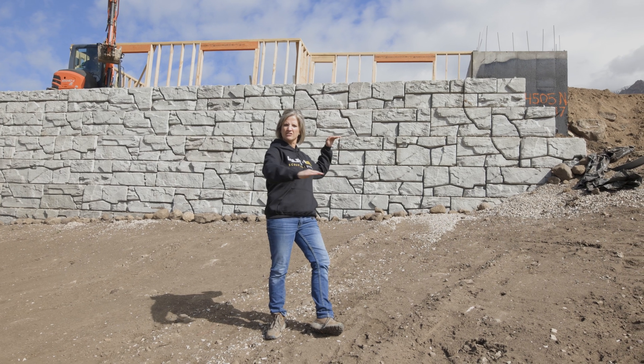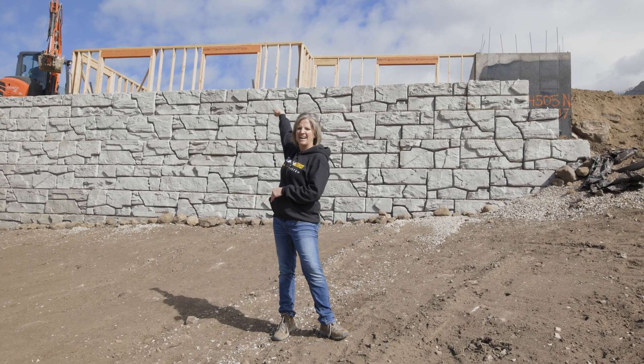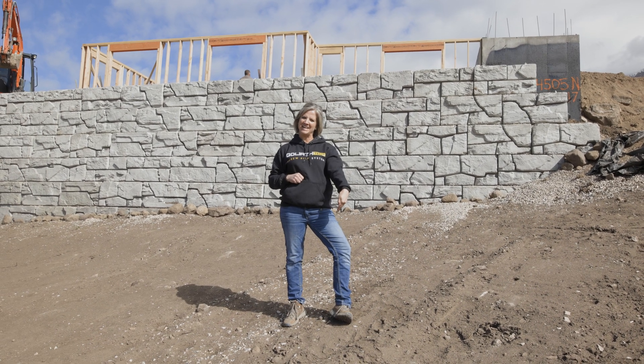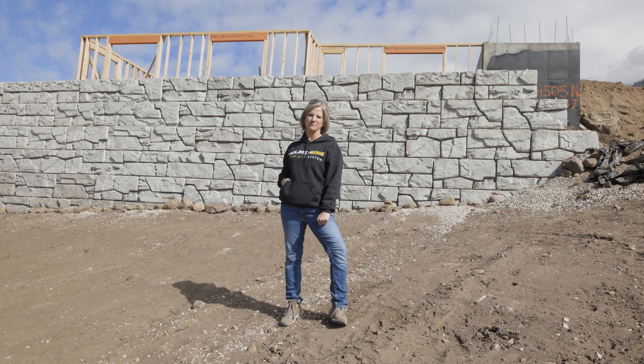You can see that the natural slope is quite deeper than the height of the house. This allows us to put the helical piles down until we reach past native soil, while still having this lot available to build on.